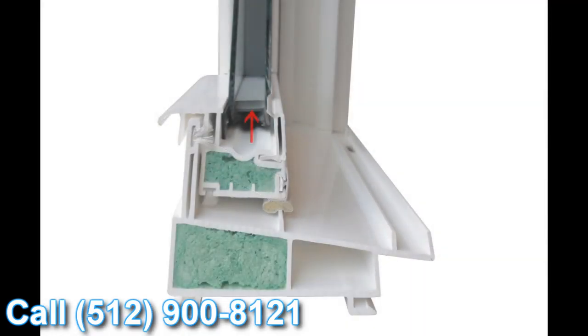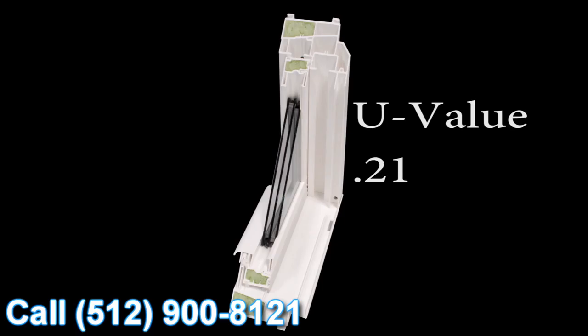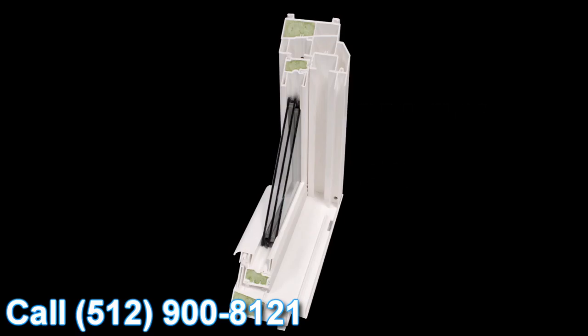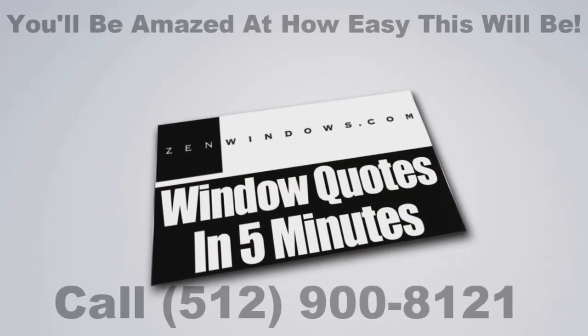We've talked about many features and benefits of the Lotus window today — from the 12-point fusion welded technology to the Certiforce Constant Force Balance System, all the way down to the super spacer glazing system. The final standard feature I wanted to go over today was the triple glass system in the Lotus window, which we call the Ultra S glass system. It features super spacers, triple glass, two coatings of climate control low-E, and argon filled in both chambers. This results in an overall U-value of 0.21 and a solar heat gain coefficient of 0.26, making the Lotus window Energy Star rated and recognized as an Energy Star most efficient product.